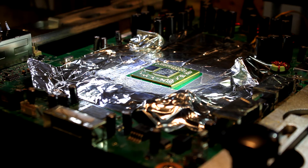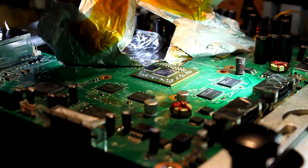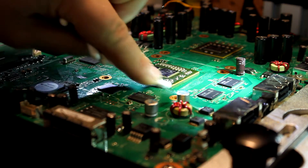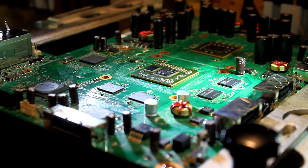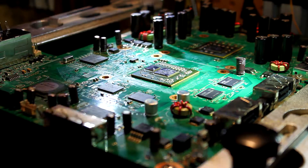Very gently, we're going to move the top heater. Turn the top heater fan on and just let the system cool itself down. The board's at about 80 degrees Celsius, so I'm going to lift the tape. Never lift the tape right after — you can actually lift up components that are on the motherboard. Take some Q-tips and get whatever flux you can before it dries on there. You can use a little IPA, and once it's tested and everything turns out okay, it'll get a good scrub down.